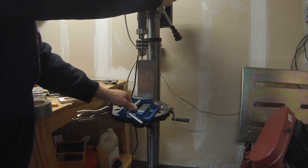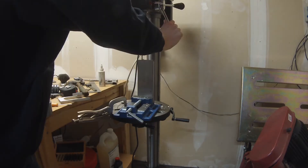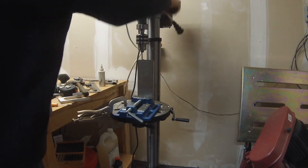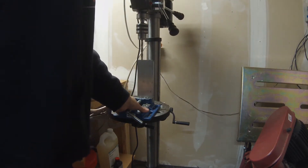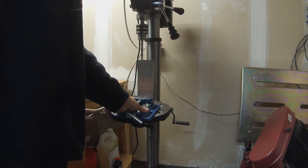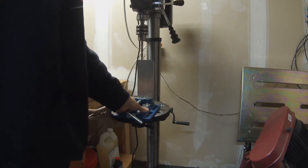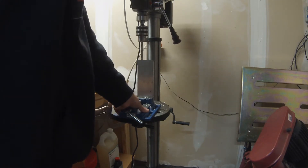This is just a centering bit to try and get this hole as perfectly aligned as I can. This is a 5mm drill bit. We're going to tap that up to M6 by 1, and then this is a 13/32nds — a little over 10mm. The head of the bolt is going to be a 10mm Allen key, so we want it to sit down in this hole — it's just like a counterbore.